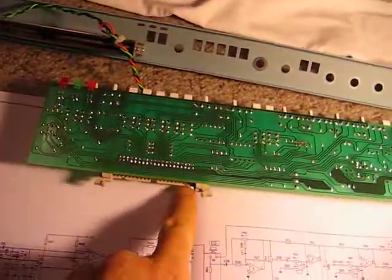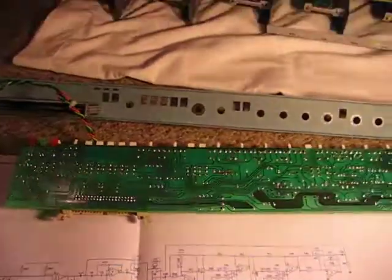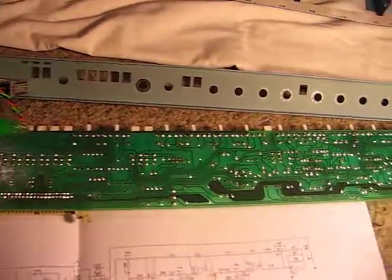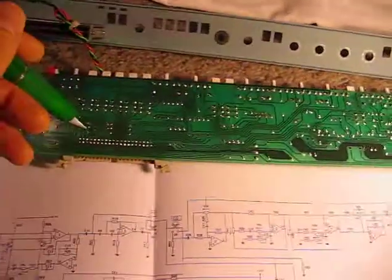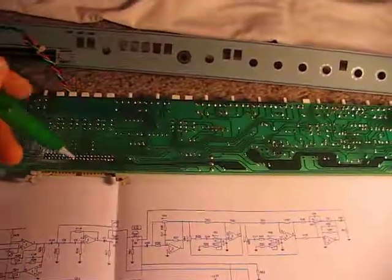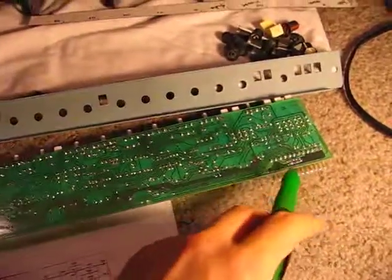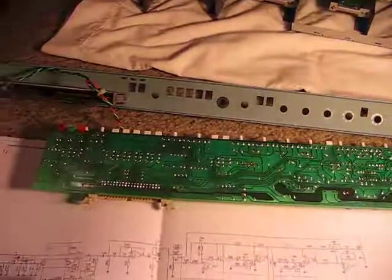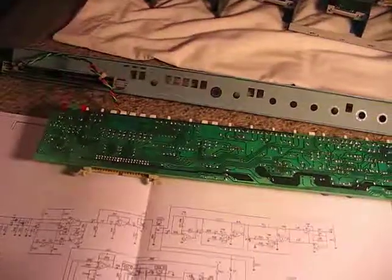In a little bit we'll see where that chassis ground pin goes as we go down the system. But that's where all of the circuitry on this PCB gets its ground reference. It's not coming from this connector. It's coming from the I/O connector through the system and then heading out down along the line. So next we'll follow that down to where that goes.